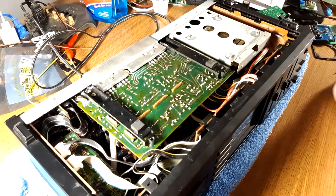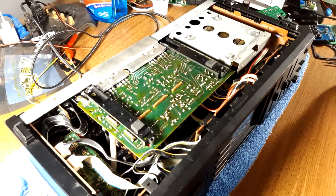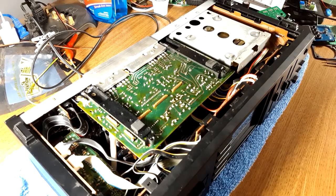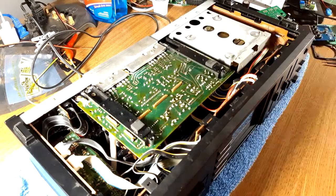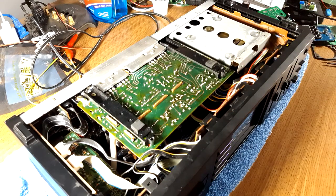Why this thing — and a very brief rundown of why a lot of amps are not 4-ohm stable — it's not necessarily because the output devices can't handle the current. The problem is heat dissipation. Let's say you have a 60-volt rail — this one is actually higher, about 70 volts. You run a 4-ohm load, you have less resistance so it takes less voltage to get a given amount of current to flow. That voltage going in, and lower voltage coming out with high current — that voltage has to be dropped somehow. Normal BJT transistors are essentially a variable resistor. Imagine them as a very large potentiometer you are turning thousands of times a second. That's essentially what a BJT is. A MOSFET is more like a switch — it's on or off.